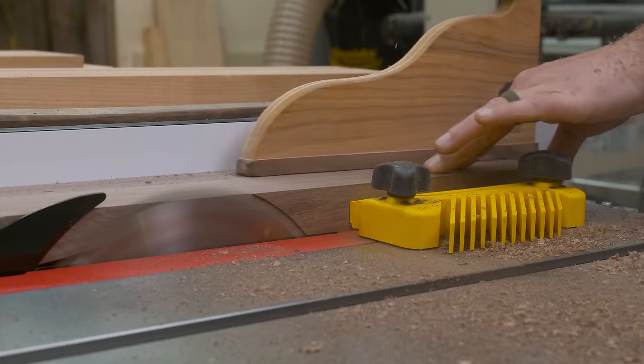The next step was to work on the large mortise in the center of the chop and the center of the leg. Since this is such a huge mortise, I decided to use my Forstner bit to remove the bulk of the material before going to the router — this saves a ton of wear and tear on the router, the bits, and my stress levels. Once I had a hefty amount of material removed, I cleaned up the mortise with the router using my edge guide. When using a router to remove material like this, keep the material you're removing on the opposite side away from the edge guide. Next I routed a circle for the inset bushing using templates and a templating bit, routing the hole until the bushing sits just under the surface.